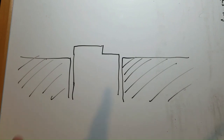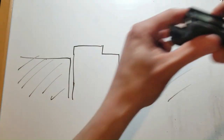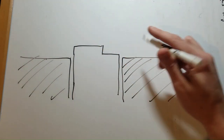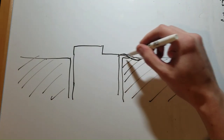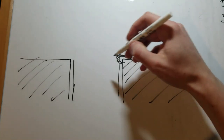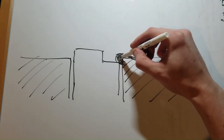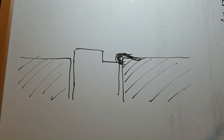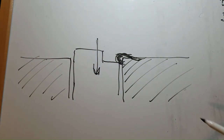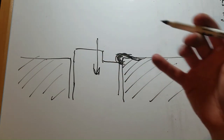I just love drawing pictures so I figured I'd break out the whiteboard for this. Here's your firing pin safety block — we are looking at it in the bolt and it moves up and down in this channel. What's happening is this material is getting squished and mushed in here, so you'll build up a little ridge of material. Over a long amount of time the firing pin safety block gets stuck under this squished burr of material that forms around the firing pin safety block hole, which means it gets permanently pushed down and disengaged, allowing the firing pin to go forward — making the firing pin safety block inoperable.